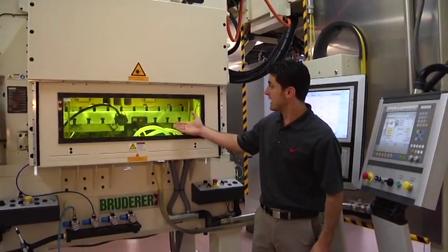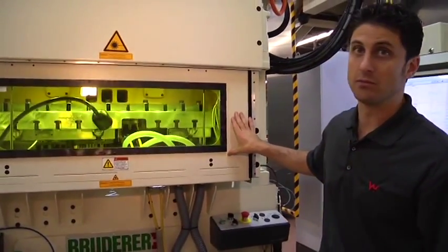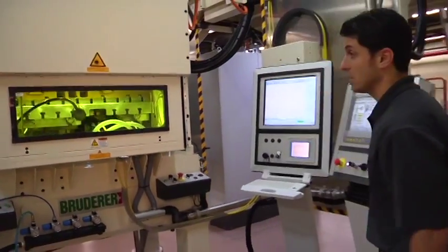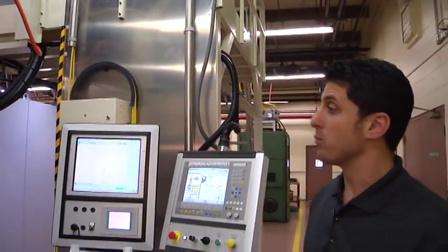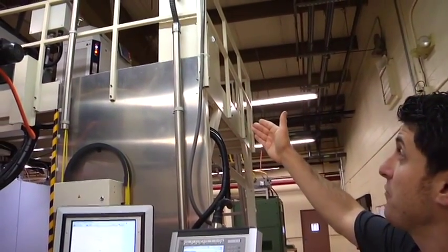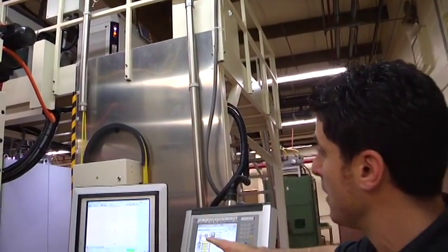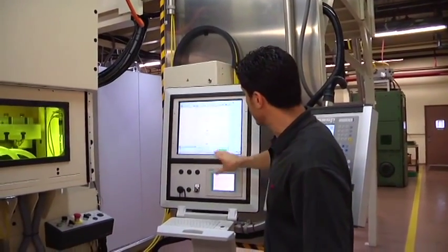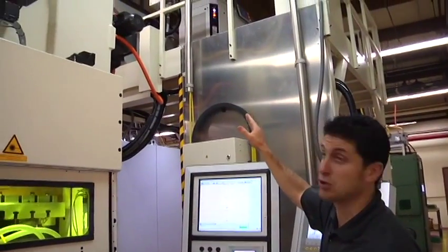And now, as you can see, the laser is firing and the tool is running. All of our guard systems are down. Now we're going to go upstairs and take a look at the three peripheral equipment that will be stored upstairs: the gas extraction unit, the laser itself, and the auxiliary equipment for the AutoVision system. Obviously we don't have a full computer here — we only have the touch screen and the Siemens PLC, but the actual CPU and data server is upstairs.